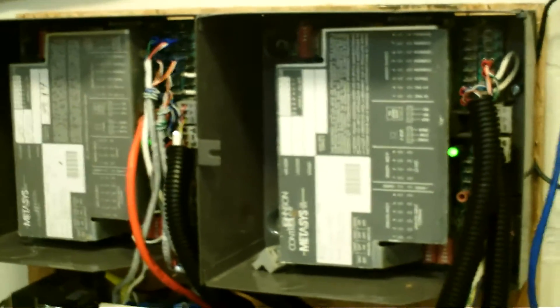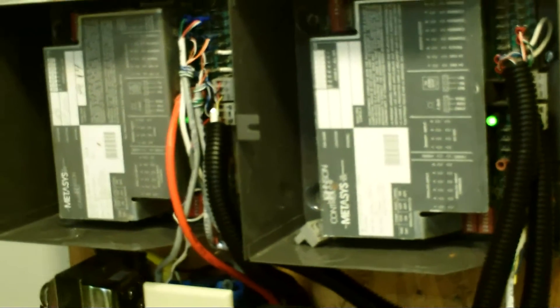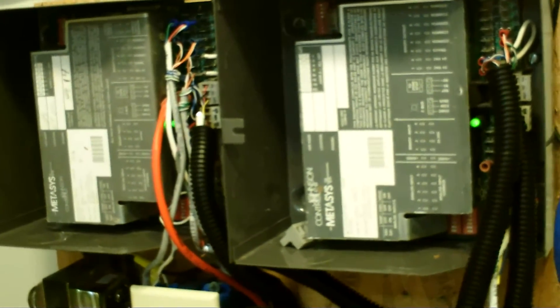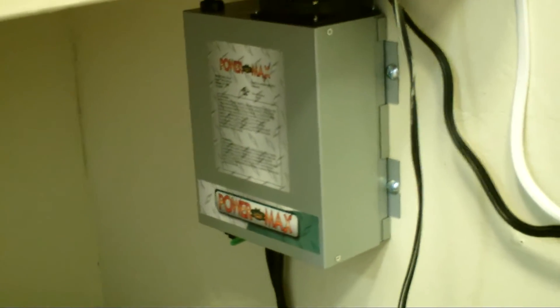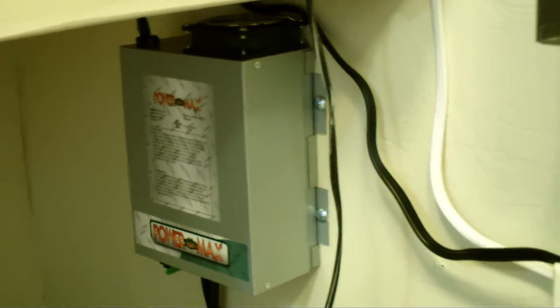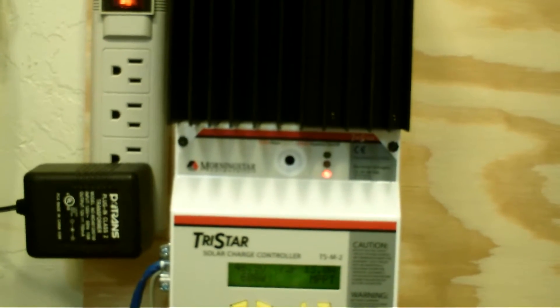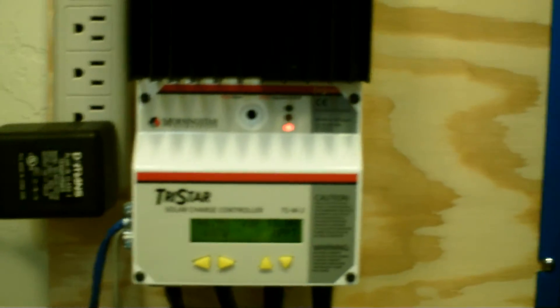These are our controllers that I have on the system. Basically, they monitor the temperatures in the greenhouse, tell the hydroponic pumps when to turn on, and also monitor the battery voltage. The reason I do that through this system is I have a forklift battery charger down here — it's a 48-volt system — and since I'm running computers in there, if the batteries got too low and needed to switch over, it kicks on that charger and I don't have any interruptions in the computers, and I don't have to use any UPS units.